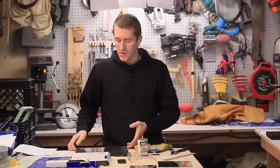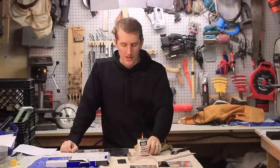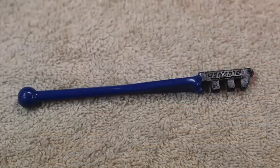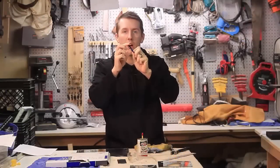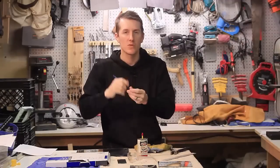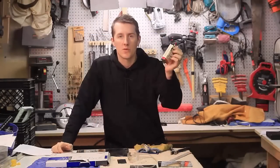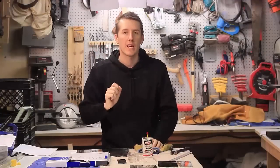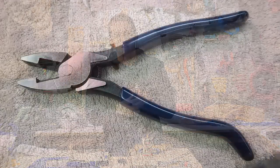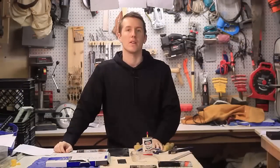This is a quick lesson on how to cut glass or a mirror. This is an eighth inch thick mirror, which is a standard thickness. The first thing you need is a glass cutter — you can get one for five bucks on Amazon. The important part is it has a carbide wheel on the front, and you use that wheel to score a line on the mirror to tell it where to break. You can't use steel, a nail, or a screwdriver — those just slide on the surface. You'll also need a straight edge like a ruler, some oil (three-in-one oil, olive oil, or any type) for lubrication, pliers in case it doesn't cut cleanly, and safety glasses and gloves.